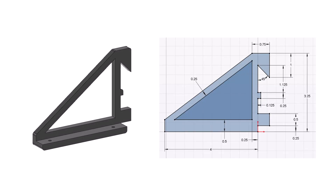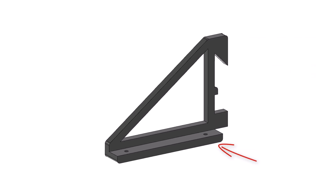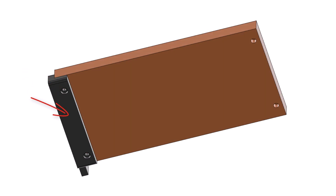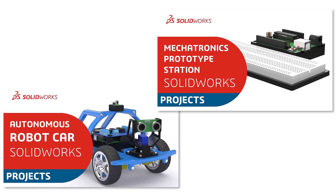The design for the shelf hangers has the same features as the other hangers on the cleat side. On the shelf side is a ledge that the shelf sits on. On the bottom of this ledge is a counterbore hole for a 3mm pan head machine screw that attaches to the bottom of the shelf with a threaded brass insert. For the shelf hangers, there is a right and left side. Check out these other videos for examples of how I use brass inserts and machine screws in my designs.